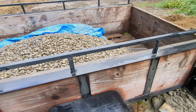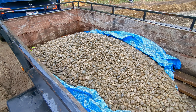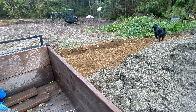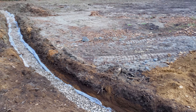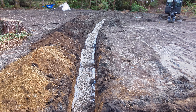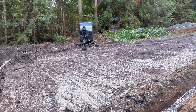I took the farm Tesla to the local rock supply and got inch-and-a-half round drain rock, which I'm now going to throw into the ditch. I now have a light bed of rocks in the trench. It is pretty clear that the excavator has a bucket on it that's too wide, but I don't have another bucket - I have one on order on Amazon.